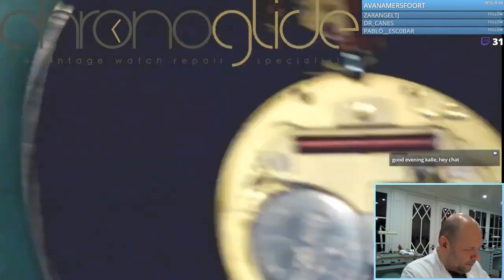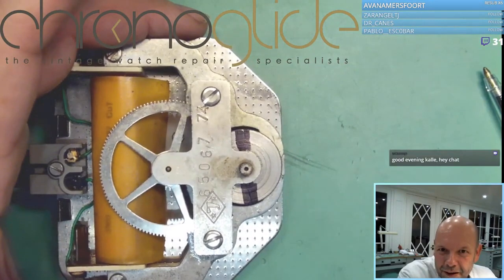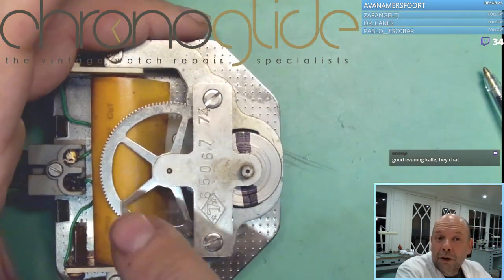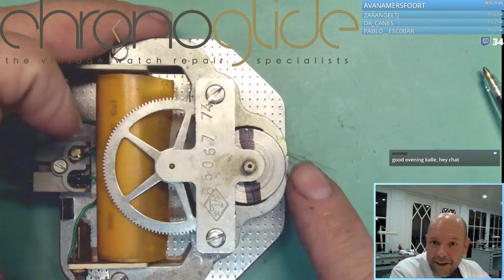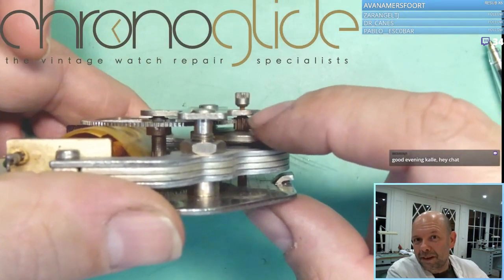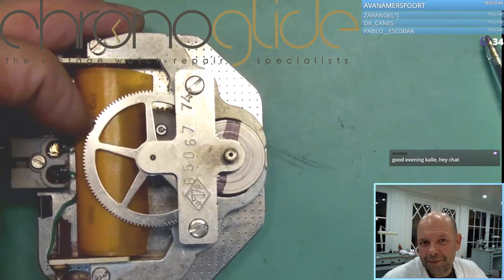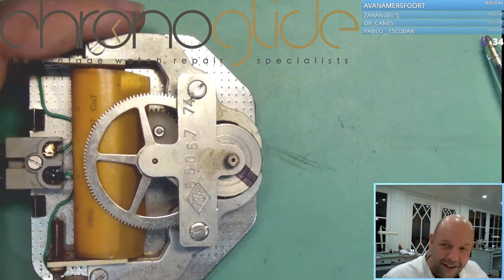Then this will happen. Well, this is a coil. A friend of mine gave this model from a step motor, and I'm so happy with it. I'm so glad I'm allowed to use it. This is like a coil, and with a magnetic switch you can turn on and off. Here, this one is a permanent magnet with a small pinion. If I move it, you can see it does not rotate easily, it just flicks because it's a magnet. So every time this coil gets a pulse every second, exactly on the second, because of the quartz movement.